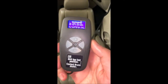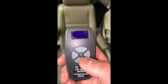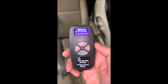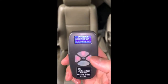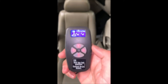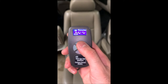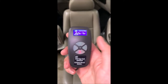If we're ever having any issues with the seat, we will see a warning pop up that says the seat has lost its position. This can typically happen if the battery in the car is starting to go down and it drops voltage as the seat is going in or out. You'll get this menu where you can scroll down and read everything. If you hit right, it'll take you to this menu. This seat has three motors: one for the forward and back, one for the swivel, and one for the up and down.